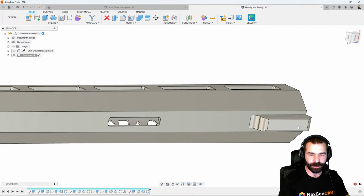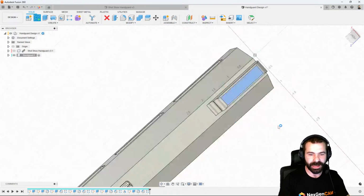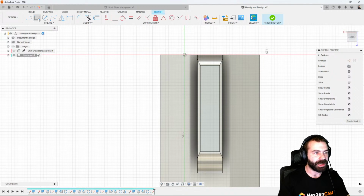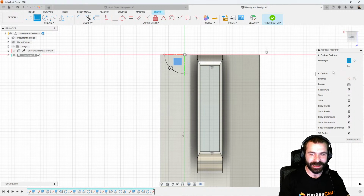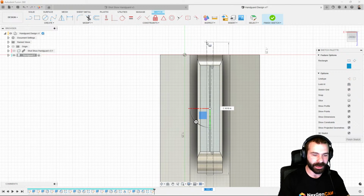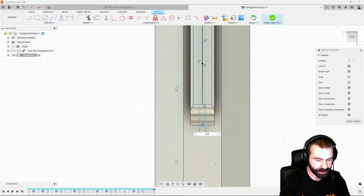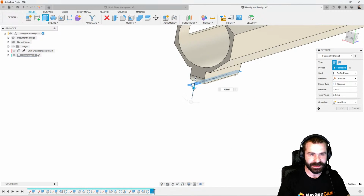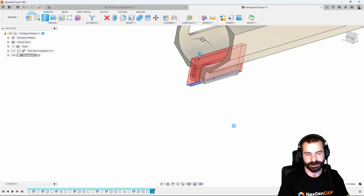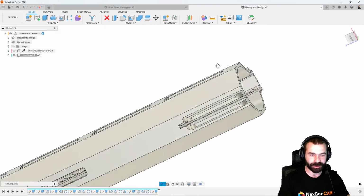So moving on a little bit, we do need to actually clamshell this so that we can create our tightening feature. So let's go ahead and edit and create another sketch. I'm a big fan of rectangles, as you guys are starting to find out here. Once I have my center line, I could just very simply drop a rectangle from center, and I could drag out that profile to whatever I want it to be at the end of the day. And in this case, I like the idea of that being 0.125 wide. And once again, I could constrain this even more to make my life easy, but I like just putting some designs on paper long before doing anything. So there we go. We have that nice little clamshell design now.